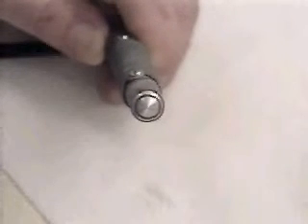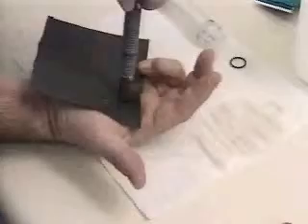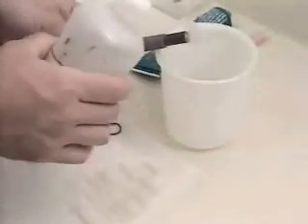Inspect the platinum cathodes. They should be completely clean. The surface of the platinum must be completely free of dents or deep scratches, but it should not be highly polished. A light pattern of concentric scratches should be visible across the surface. These slight grooves provide room for electrolyte between the membrane and the platinum surface. If the platinum surface could not be completely cleaned using a paper towel and water, the surface should be cleaned as demonstrated here. Use clean 220 or 300 grit wet dry emery paper and twist the sensor three or four times using a clean spot on the paper each time. Rinse away the dust from the tip of the sensor when you are done.